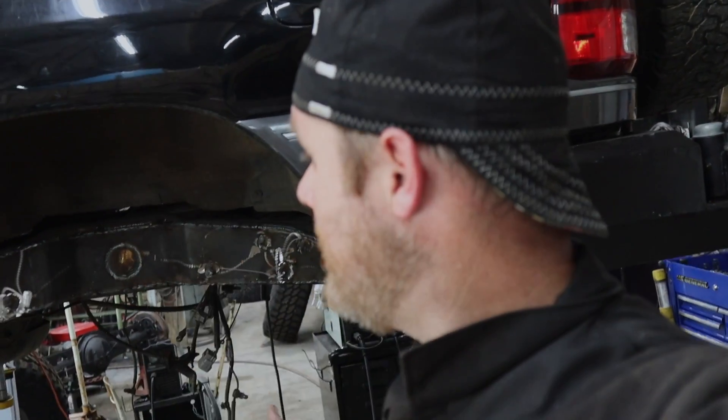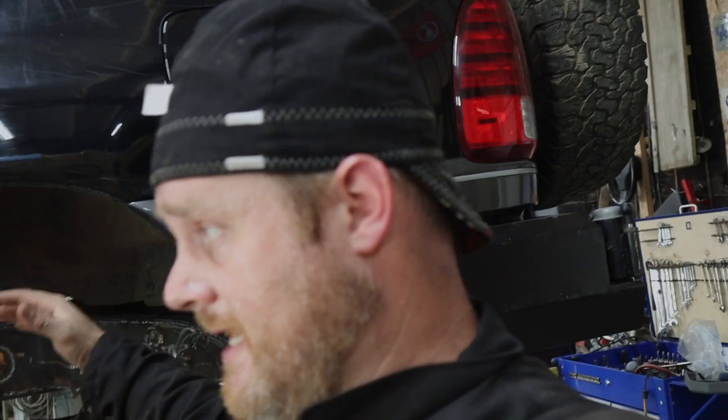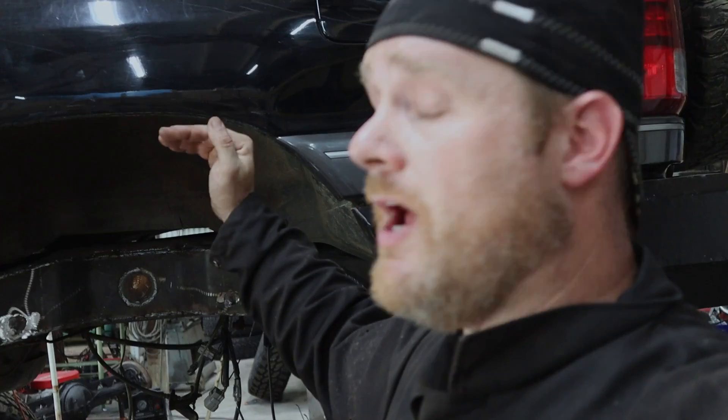Now I've got both sides of the frame notched in and ready for the ORIs. Now I've got to go back to the design table and design some strut towers that'll work with this so I can get my ORIs up in there and have the most amount of droop possible. I'm going to be cutting up into my fender wells and I'll have the shock towers go right up to underneath the wings on my drawer system in the back. That's going to be it for this video — we'll see you next time.